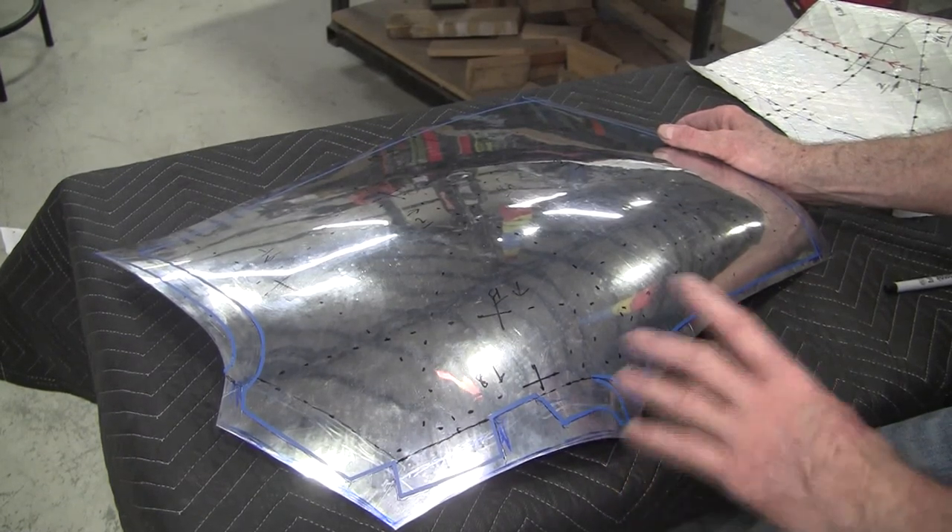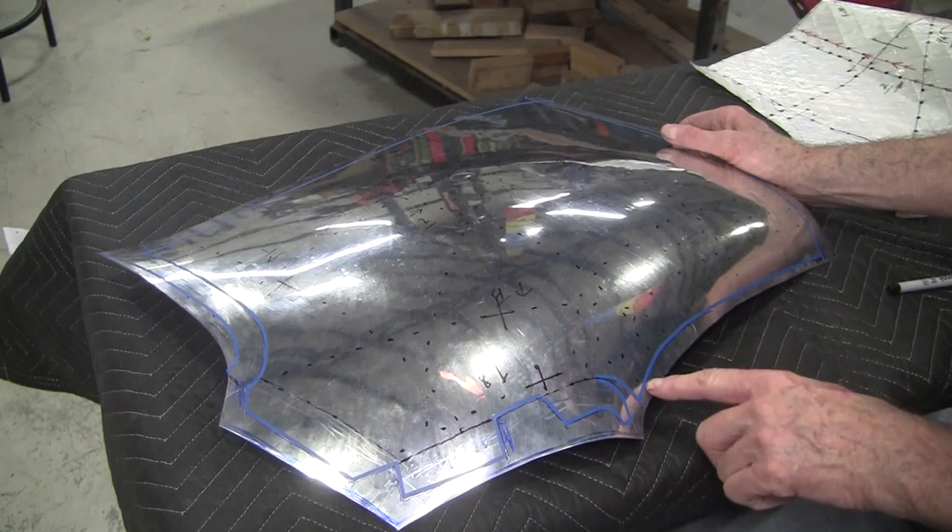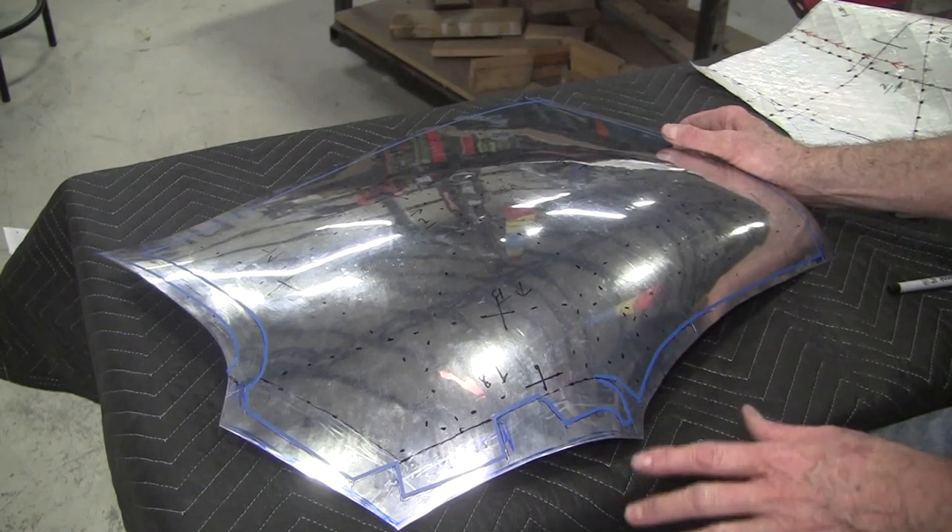These are the flanges and we've got the tip points of them right here — they've got to be tipped. Around the perimeter it was originally the super fine Sharpie, and I translate that into blue vinyl tape, which is the detail tape or pin striping tape. It's made of vinyl rather than masking material, makes corners really nice, and I use that exclusively on all my cutting. As I mentioned before, I will always cheat a little bit — I'll leave a little extra material, which can easily be ground off later. If you cut right on the line and you needed a little extra material, you don't have it.